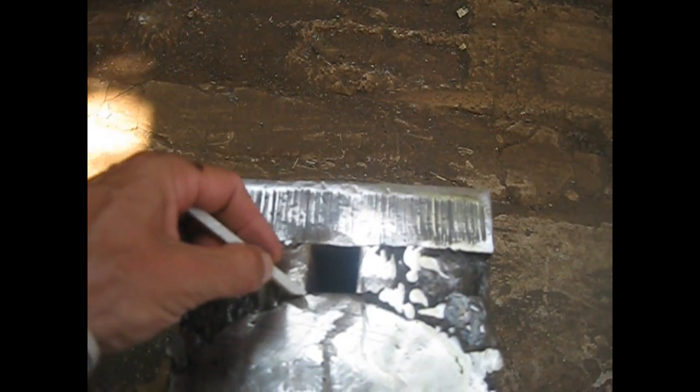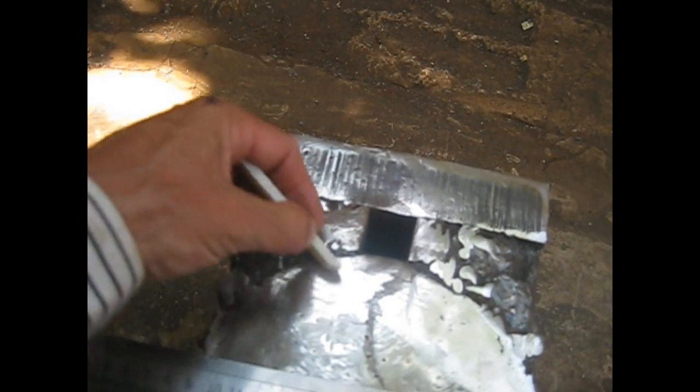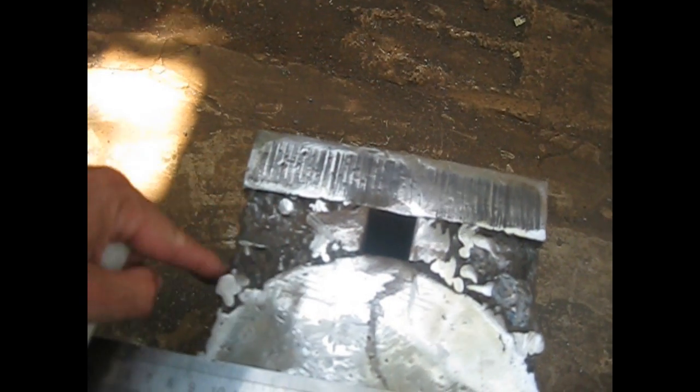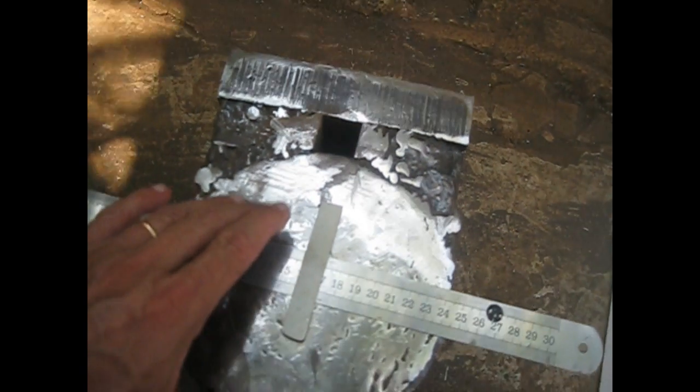Next time I think it is suggested to take a block of steel and machine it, with an angle, with a chamfer that can be welded, but with a built-in hardy hole, to avoid this relative movement of the plate in relation to the main body of steel.